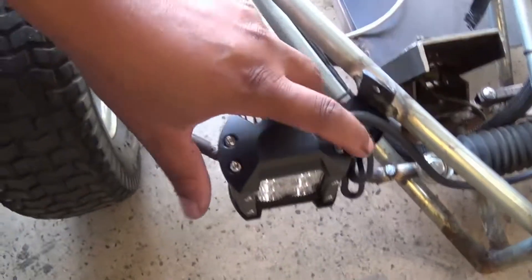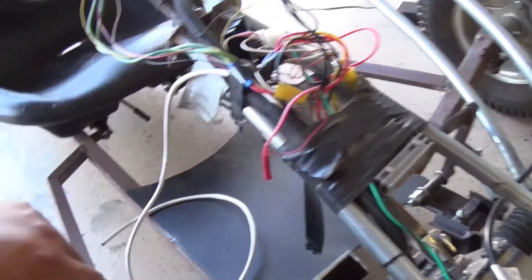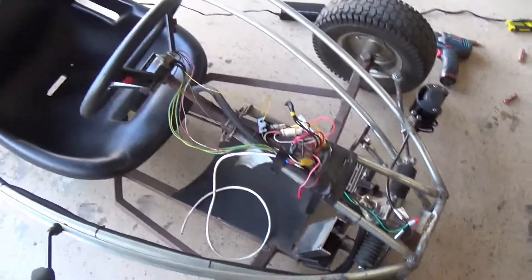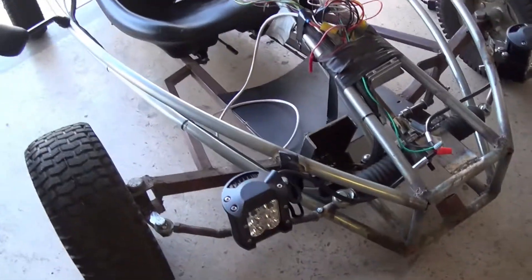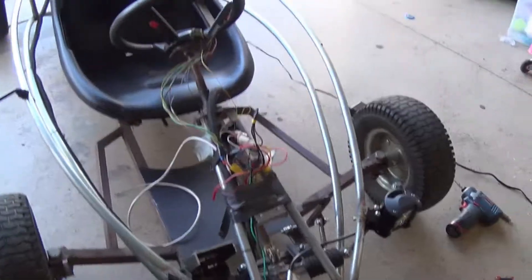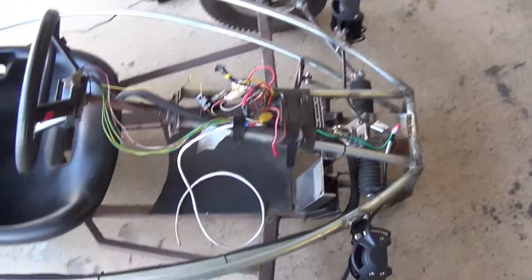Some new lights — the other halogen lights blew out when my power regulator fell. I got a more hefty one, a golf cart regulator, right at 12 amps. These are cool LED lights and they're pretty bright, so no problems with those at night.